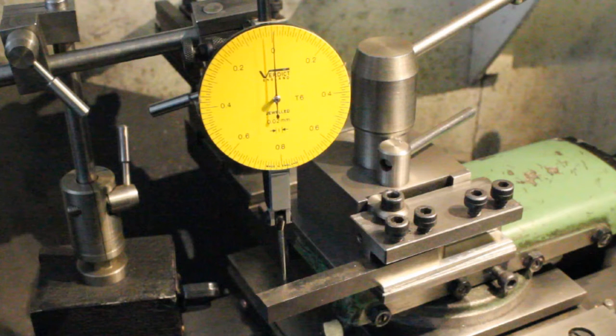One important aspect of the design for the home workshop is that there is very much less milling to be carried out, the groove for the cutting tool in the tool holder being the only major one. This means that it would not be an impossible task for the lathe-only workshop owner. You can see from the following slides how the half round grooves in the holders were made — much simpler than machining large amounts of metal away to produce the dovetails. Having mentioned dovetails, I consider my locating surfaces also to be dovetails, but inverted and being very slightly curved.